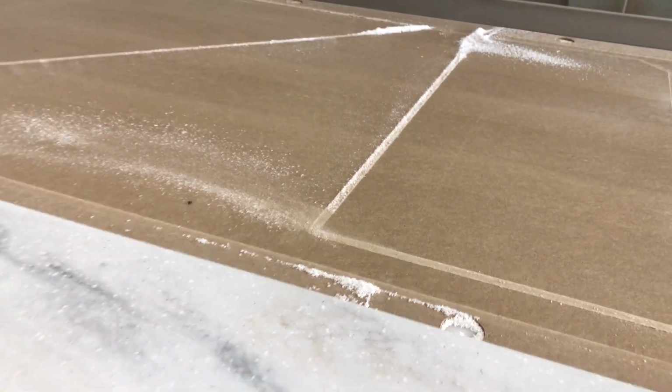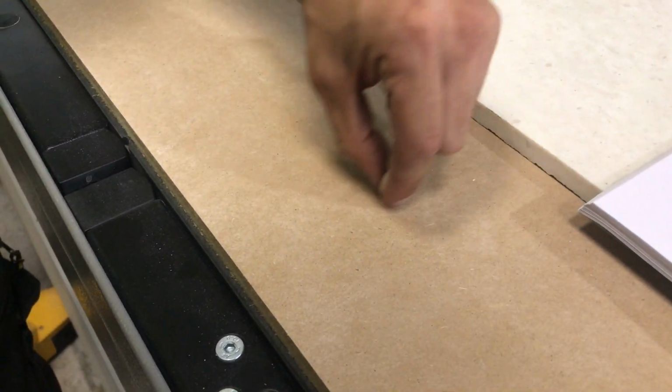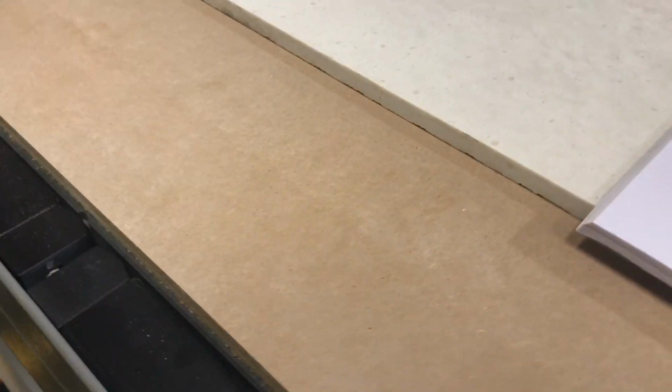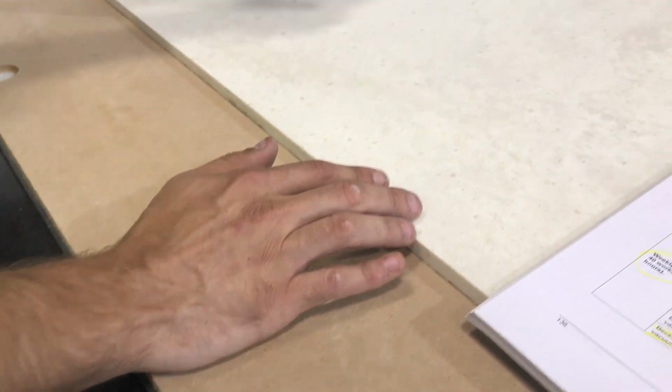If the groove is exiting the table, like it's cut outside of the table, that means that if you have the piece on top, the vacuum can actually escape through that one. That's when you want to fly cut the table again, to give it a new clean surface.